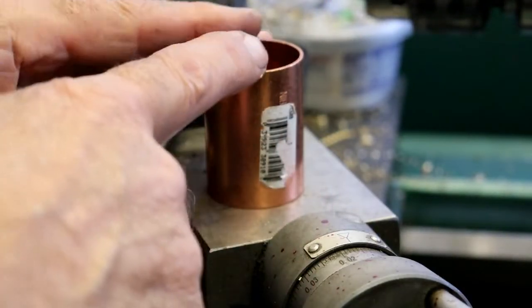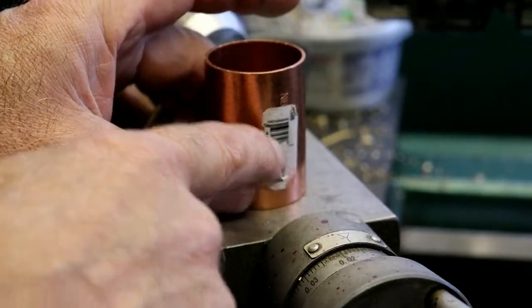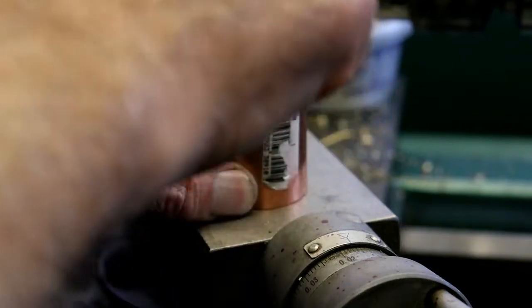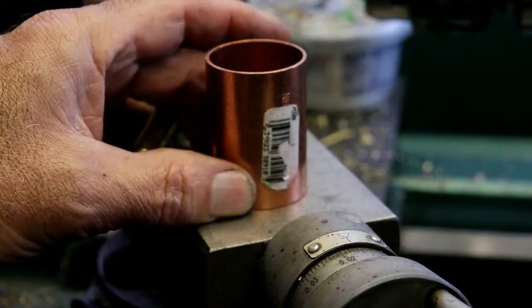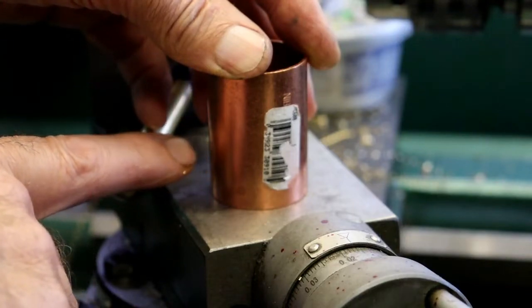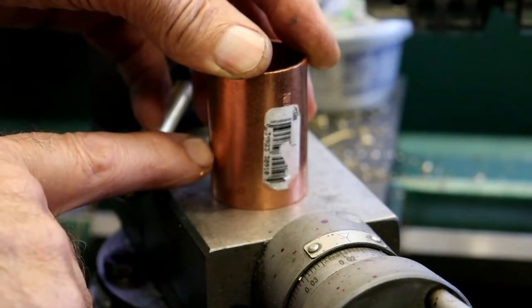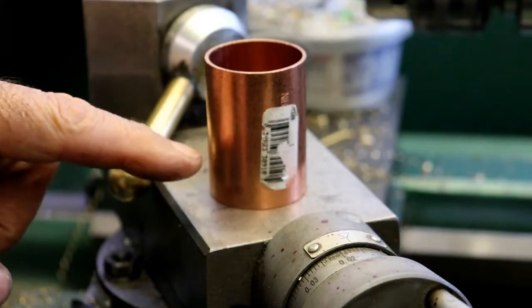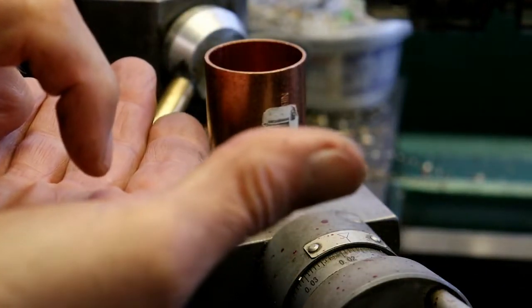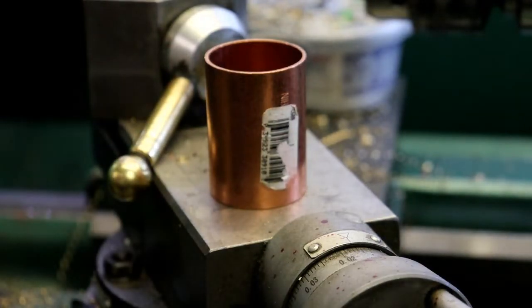And then the top plate, and put a flat plate on the top with a filler hole in it. And I'll put my gas fitting in, coming in the side here, and it'll have a hook in the outside, and it'll be just slightly off the bottom of the tank.